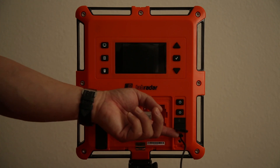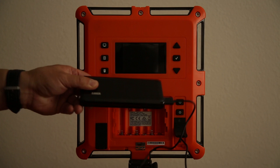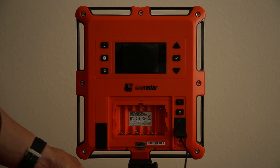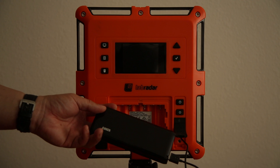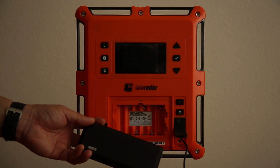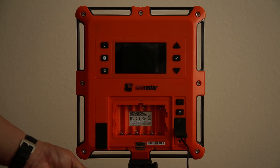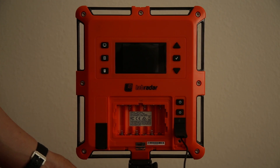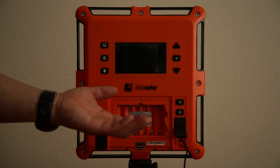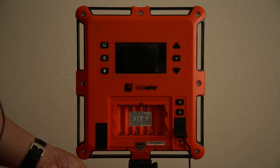It's also powered by USB. There's a micro USB port here, which can be attached to a USB battery pack — it needs a five-volt, one-amp power source. Pretty much any battery pack you can buy for smartphones or tablets will work, as long as it can provide five volts at one amp. This old Anker unit I have, I bought a couple years back to charge my iPad and iPhone. These are smart devices that only provide enough power to what's drawing it, so it's safe to use most decent-quality USB battery packs.